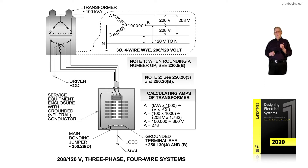That means we could pull, in a raceway system, three ungrounded hot conductors — L1, L2, and L3 — and have one neutral pull through there, with L1, L2, and L3 sharing that neutral. Notice this is permissible when we review Note 2, section 250.26 item three, in conjunction with 250.20b.